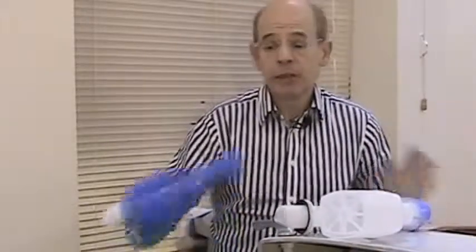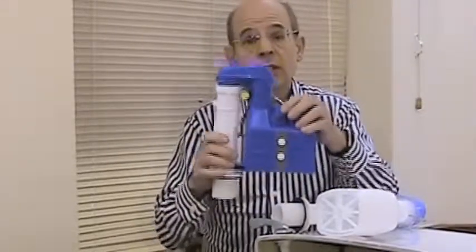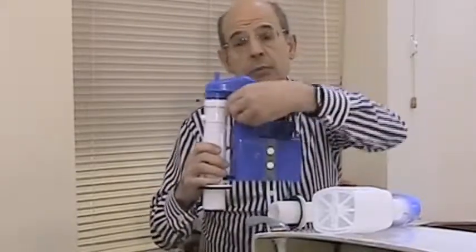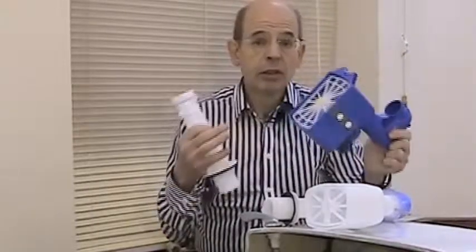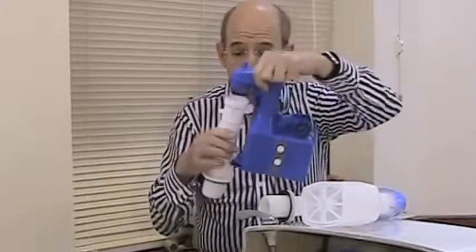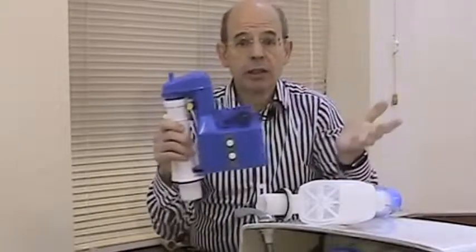This is a standard kind of siphon you get these days — costs about five pounds or so. But if you feel like spending nearly 20 pounds and getting yourself a Dudley, this is a Turbo 88. When this is fitted in the cistern, if the diaphragm goes, take the lid off, put your hand in and pull out this yellow connecting plug. You can remove the siphon like that, change the diaphragm — you can get them for a fiver on eBay — and just put the bits together like that and there it's done.